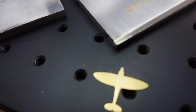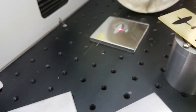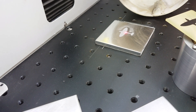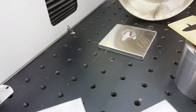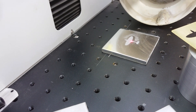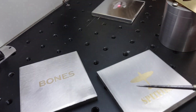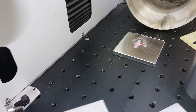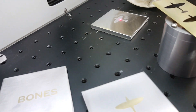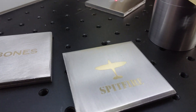After I've cut my design out in brass, I then did exactly the same size in aluminium but this time engraved it. You have to keep your eye on the depth — if you go too deep you're going to be working the aluminium back a bit. If you're a bit too shallow the brass will be proud and take more work to get flat. If you get it just right you'll have minimal work.